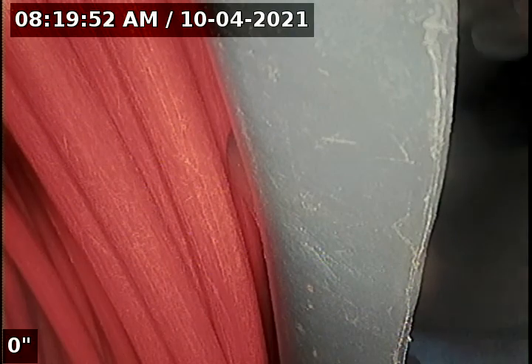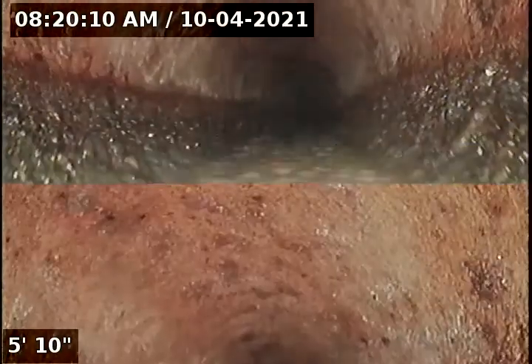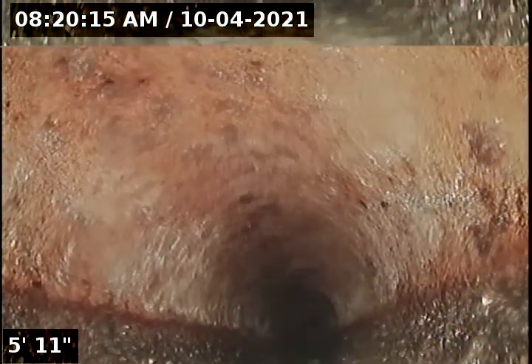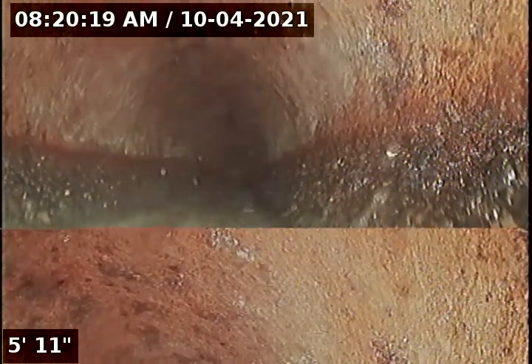The house is facing north. I'm here on the north side of the house right in front of the door, your garage door. Right in the ground there's a four inch ABS cleanout. This is probably accessing the line for inspection. As you can see I have water running downstream towards the main. Looks like we transitioned immediately to concrete. I'm going to zero out the foot counter here.